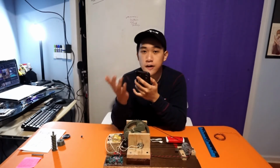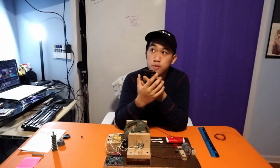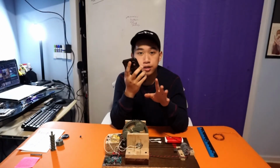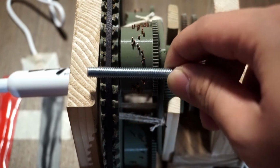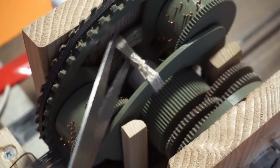Earlier in the video, I calculated the gear ratio at a 75% motor speed. In the end though, I ended up using the topped motor speed because 75% was just not enough to drive the gearbox. Granted, all of my motor problems probably would have been resolved if I just used a stronger power source. But I'm, como se dice, lazy. I should have included the ability to tie the triangle and the shift gear together with a through rod. That way, I wouldn't have to cut and tie the strings every time I needed to troubleshoot something.